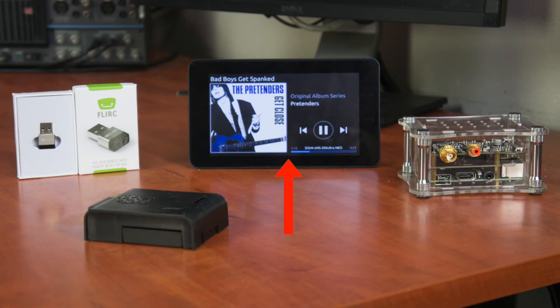When you add the Raspberry Pi touch screen, you add a third separate function that displays the music being played and offers play, pause, skip back and forward through the touch screen — and this could display music played on a third endpoint. The realistic approach is to have the Pi function as a Rune endpoint, display the cover art, and play, pause or skip music on the touch screen or infrared remote. The tablet or computer you use to choose your music keeps working as usual.